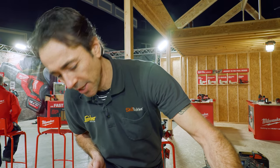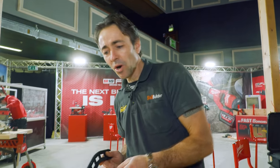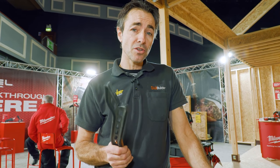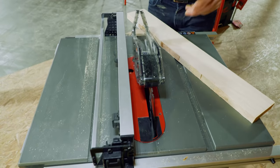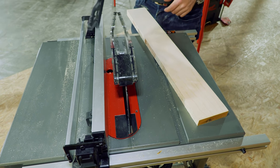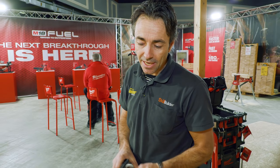I'm going to run it up for you — it's actually on a dust extractor here. I like the push stick, and what I like about it is it's always right there next to the fence, which is really useful. Anyone who knows about using woodworking machinery knows there are rules — and even laws — about health and safety. One of the things we were taught at college was you've always got to keep your hands 300 millimetres away from the cutting edge. The length of a push stick is roughly 300 millimetres, so if you're set up with a good riving knife and a good fence, you can safely feed the material through using the push stick.